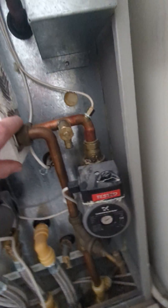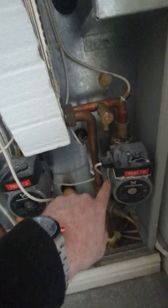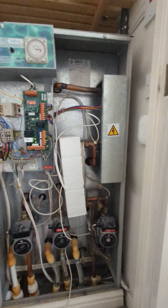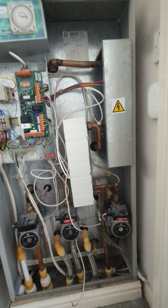There's also a pump doing the hot water — it takes heated water out of the tank and puts it around the plate heat exchanger, with cold mains coming in and hot water going out. There's been no hot water here because this pump hasn't been coming on and circulating around the plate.